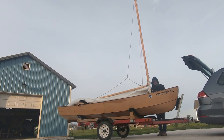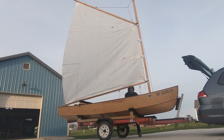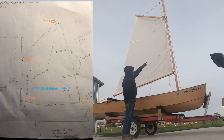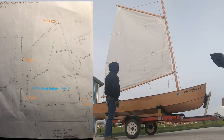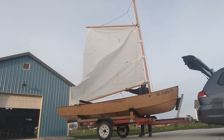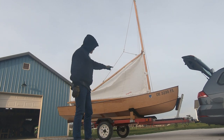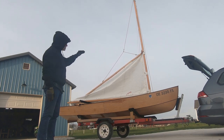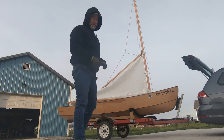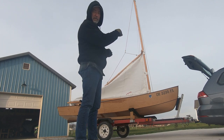Watch as I raise the sail. The final little bit of halyard tightening is for peak tension adjustment. If I were to lower the halyard to where I could attach those reef points, watch what happens to the peak. I've got the reef points tied off forward on the luff and aft on the leech with the lines I've had sitting there for five years, not used yet. We'll raise the sail to about where I want, and what I'm hoping is by simply attaching a line and pulling straight down, I can get a sufficiently decent sail shape.